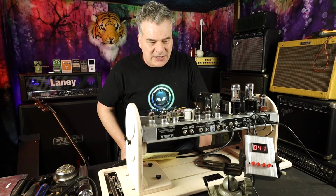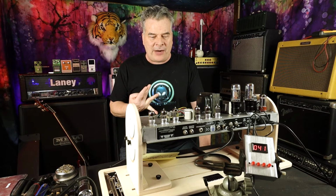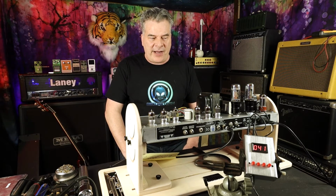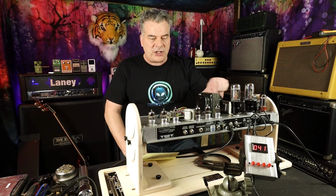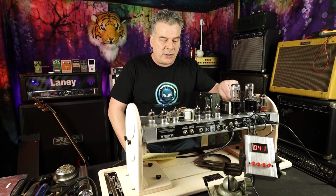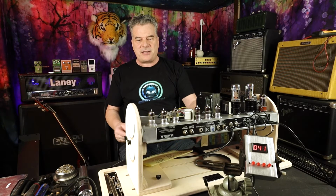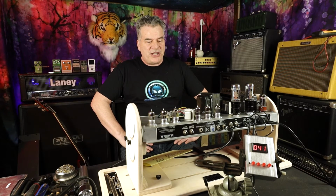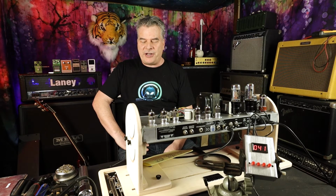This is a great little box. You'd be able to do an amplifier with up to 4 power tubes. And I should mention, some of the other amplifiers, you'll be able to adjust these in pairs. So instead of just one adjustment area, you'll have 2, like with a Marshall. So you'll be able to adjust these in pairs and work to get them as closely as possible. So I'm pretty excited about that. I guess the next time you see me, I'll have this all put back together, and maybe I'll play us a little bit of a tune.